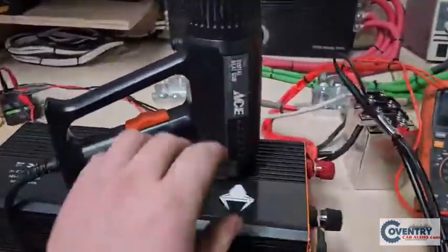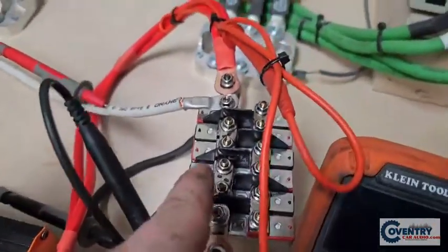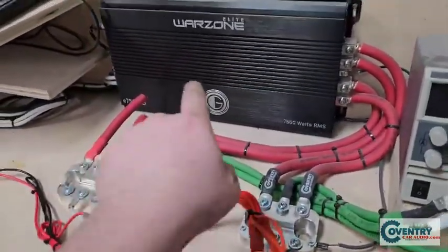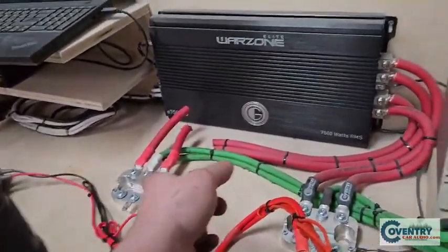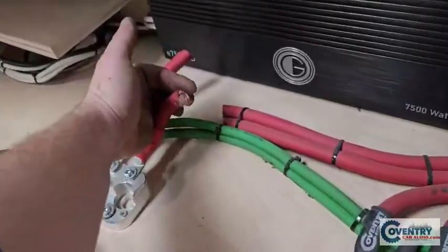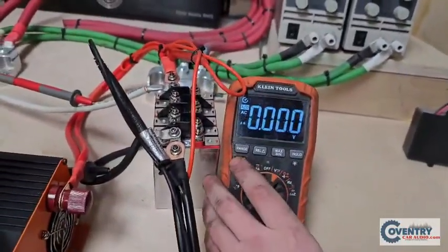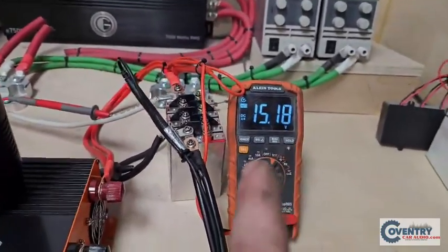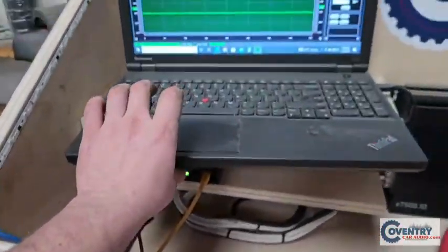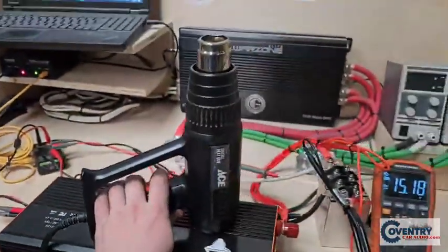Same test once again, this time dialed back to roughly 300 watts — the 6S1P battery. The only thing I thought could make this not 100% accurate is that the amplifier, even though it's not powered on, was still hooked up. I thought there are capacitors in there, so maybe it was adding a little capacitance and altering the test. So I disconnected — cut them. Power supplies are off. The battery is not even fully charged, but in the previous test it was around 15.2. Still Term Lab setup, dialed back to roughly 300 watts. Let's see how long it takes to hit 12.